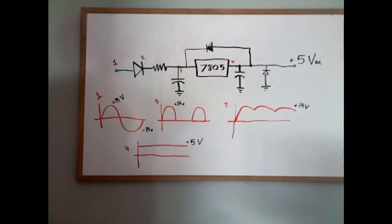I'm going to explain how each branch of the circuit works by going over one. The first stage is the input, which is 14 volts alternating current. As you can see, the wave goes up and down. When it goes through the diode, the diode only allows current to flow one way, so that's when we get a ripple like this.